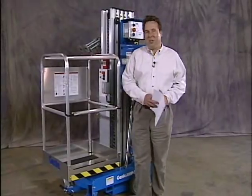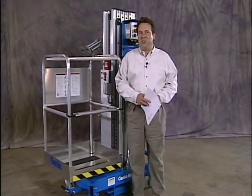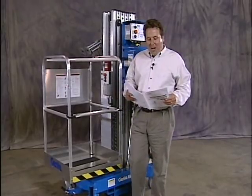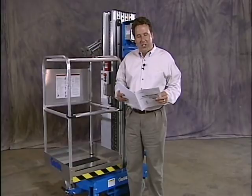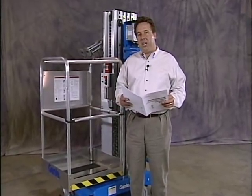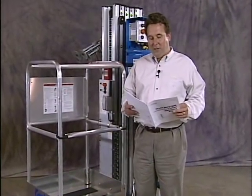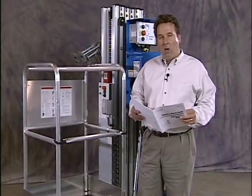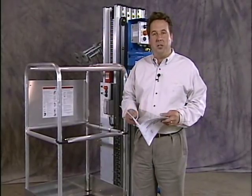The second principle of safe machine operation is always perform a pre-operation inspection. The pre-operation inspection is a visual inspection performed by the operator prior to each work shift. The inspection is designed to discover if anything is apparently wrong with the machine before the operator does the function test. Inspect the machine for modified, damaged, loose or missing parts. A damaged or modified machine must never be used.